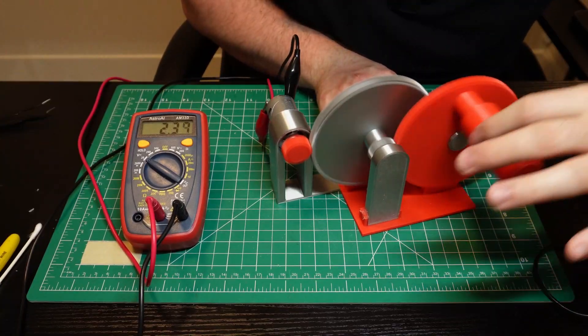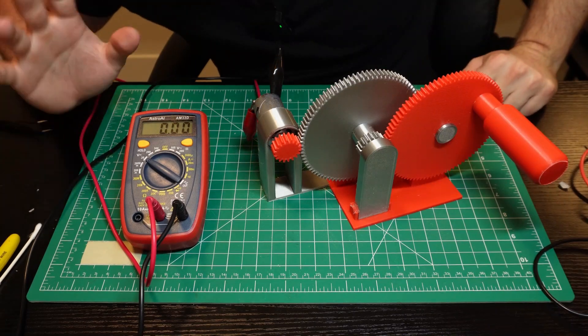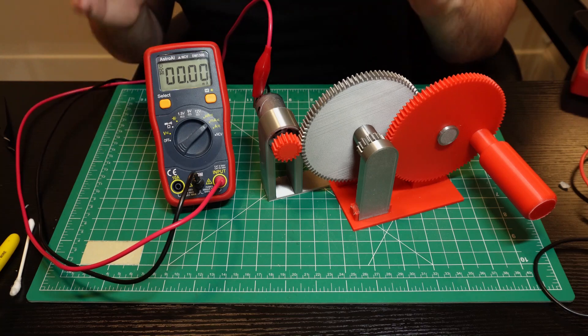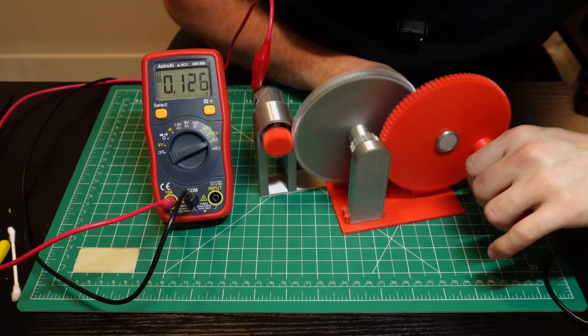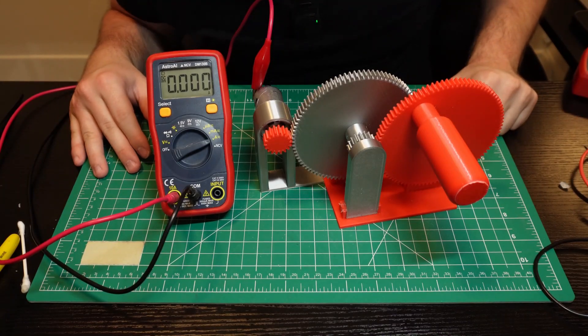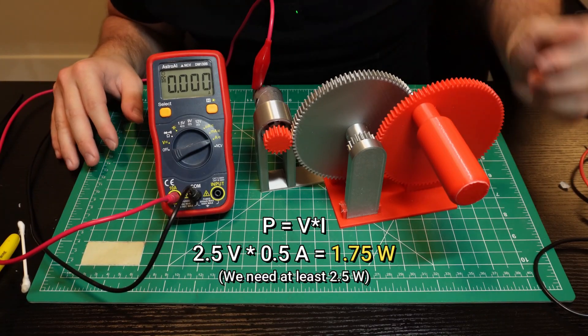That's not 5. We're producing about 2.5 volts, which is not good. I'm also going to measure how much current we're producing to see what the total power output is. We're producing about 500 milliamps, which is around 1.75 watts, and that's not good either. My assumption of making a 1 to 25 ratio speed multiplier was incorrect because it's not producing the amount of voltage that we want. The current is fine — you can charge your phone with 500 milliamps, it's going to be like slow charging, but we're still not reaching the 5 volts. That's definitely a problem.